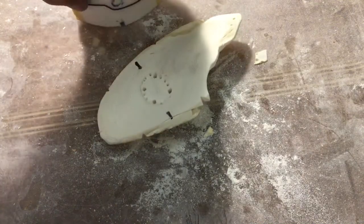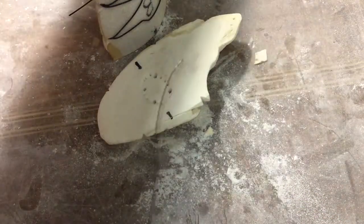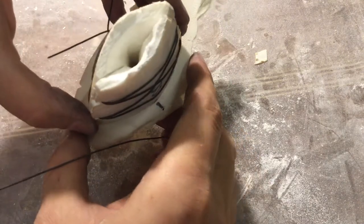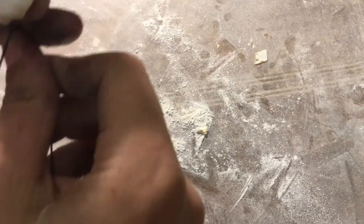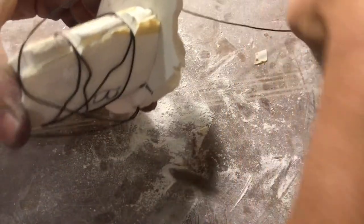For these complex surfaces, I'll pull a full length of wire — I'm wiring this with 20 gauge dead soft mild steel. Give yourself a little extra to work with; two to three feet is sufficient, then cut it short as you go. You want to make sure you've lined up Part B and Part A on Part C before you start. Check the B registration, check the A registration, then clamp it with your thumb on top and hold the material from the bottom, doing the same style wrap we had initially from the surfaces of faces A and B to get that same X pattern.